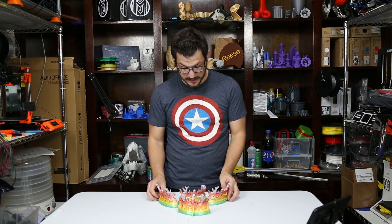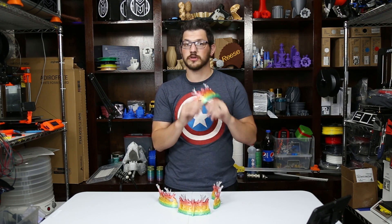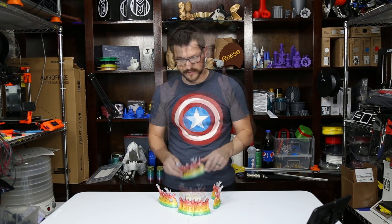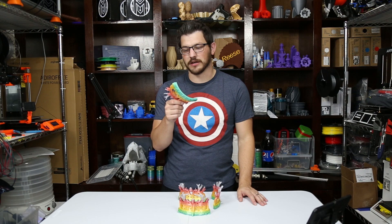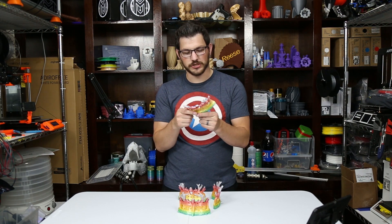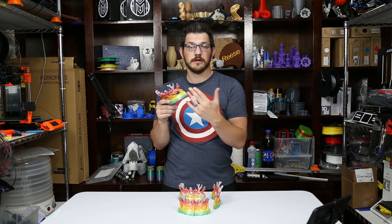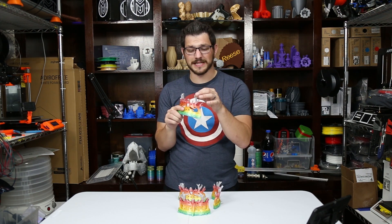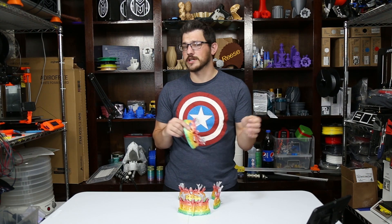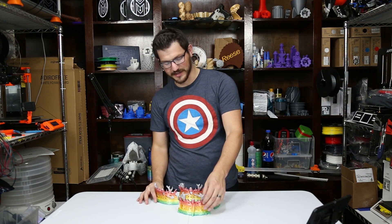Three of these are cleaned up because I went ahead and spent some time — watched Avengers Age of Ultron last night — and cleaned three of these. They take about 20 minutes for each piece to clean off the support. I should have been a little more selective instead of letting Simplify 3D put support anywhere. Simplify 3D can sometimes be a little bit over-conservative with where it puts support, and this is no different.